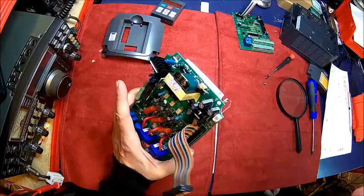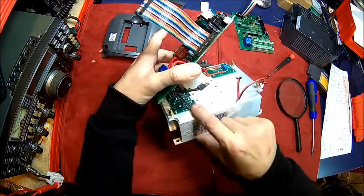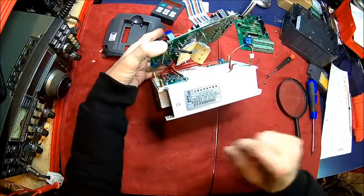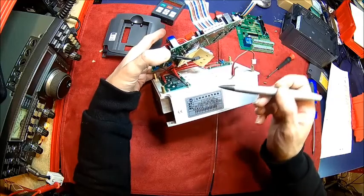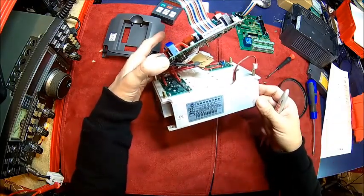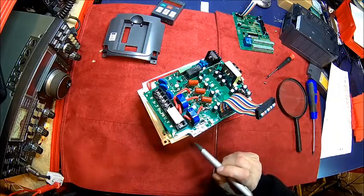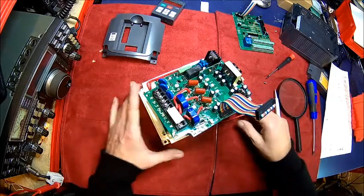What I could not get to is the rectifier — I need to figure out what that is. The only thing which looks a bit odd is this wire here. I think it's a ground wire but it looks really odd — it's just wedged underneath. They just lifted the PCB a little bit and wedged the ground wire underneath. That's botched together, definitely. There's a diode here — we don't know what it's doing. In a 400 volt drive you would use the same IGBTs, so if there is any difference it's just the rectifier — probably not even that. That means the thing would run on 400 volts as well, providing you can change the software to set the mains voltage to 400 volts.